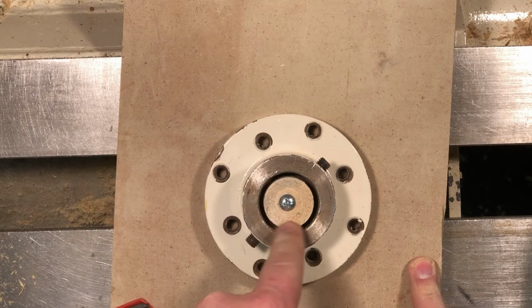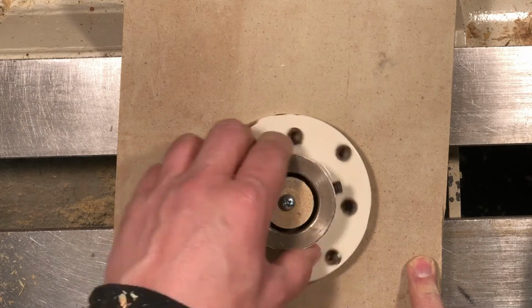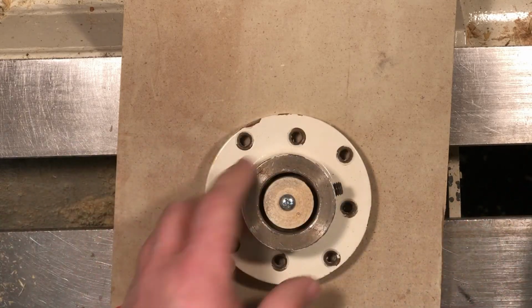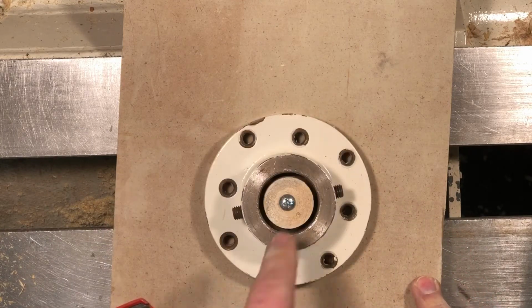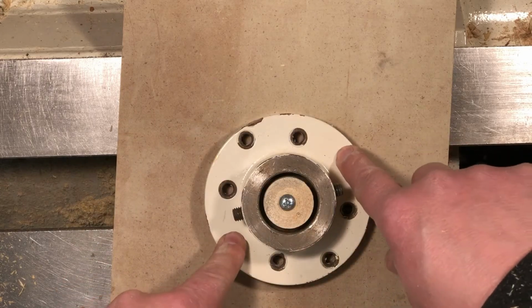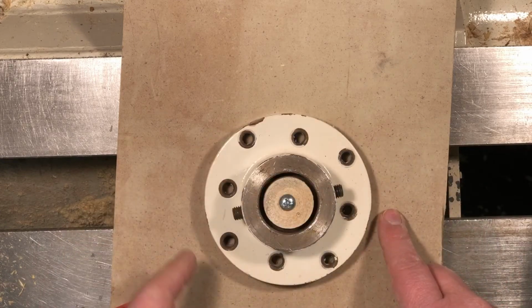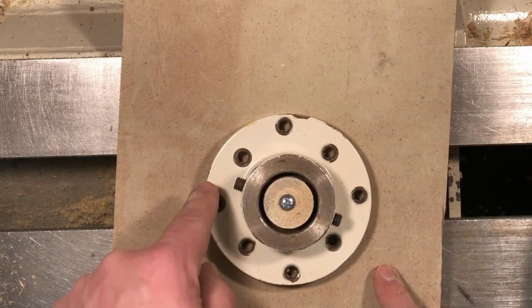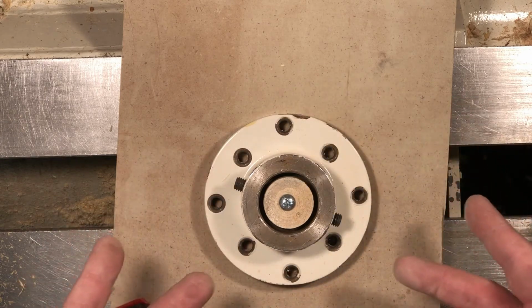The catch here is that over the course of a year, that bushing will absorb or lose moisture, and so it's going to change size ever so slightly, so maybe you need to make a new one once in a while. It's not that tough, as you can see. But now, this thing is centered perfectly, and it can only move, so when you drive your screws in, I'd recommend you do every other screw. When I put screws in like this, I like to do one side, then the other, and then you kind of do like that. Sort of like tightening lug nuts on a car.